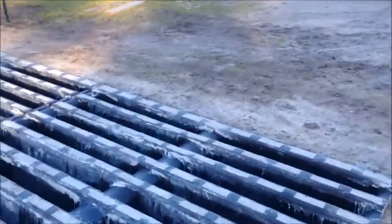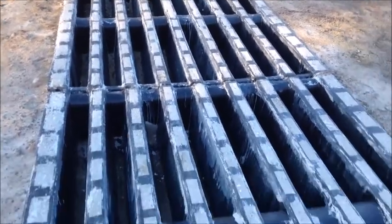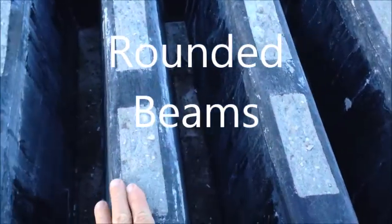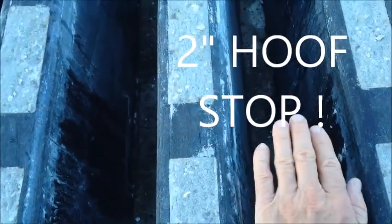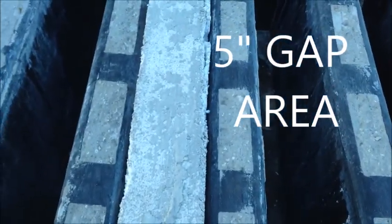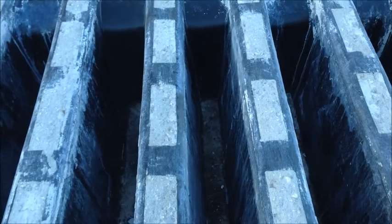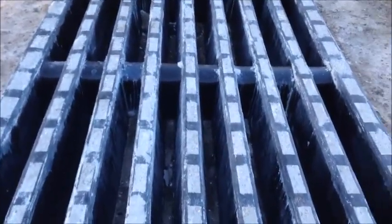Let's walk over and look at the inside. You can see where the concrete stripped on the plastic — if you like, you can spray paint it black or just let it go; the function is there. You can see the concrete has come all the way to the very top, the two-inch stop at the bottom, and the wide gap area. You can see where the foam tabs were — very useful during the concrete pour so the concrete wouldn't go down into the gap areas. You have the beams, the gap areas, and you simply take the foam tabs out after the pour and throw them away.